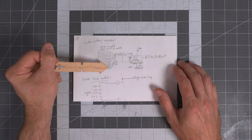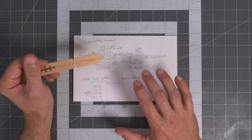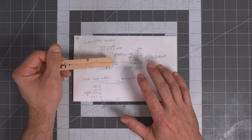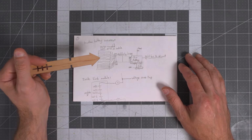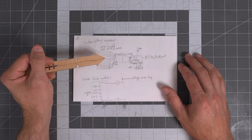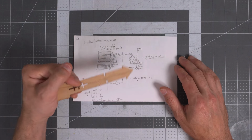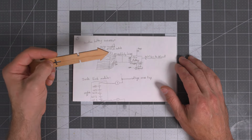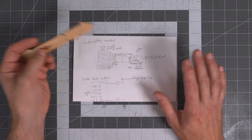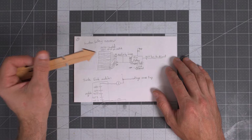In my last video, people were asking, well, if nickel metal hydride did it, why is it unsafe for lithium to do the same? Lithium has a very, very different end-of-charge and when-it's-empty and when-it's-full behavior. It's very different than nickel metal hydride. Nickel metal hydride can safely be overcharged, particularly at lower currents. There's a chemical reaction inside which continuously catalyzes and reforms a hydrogen, oxygen, and then water vapor cycle. So you can float charge a nickel metal hydride battery forever, essentially. And yes, there is a slow wear element to it, but it's very, very slow. Lithium is not that way.